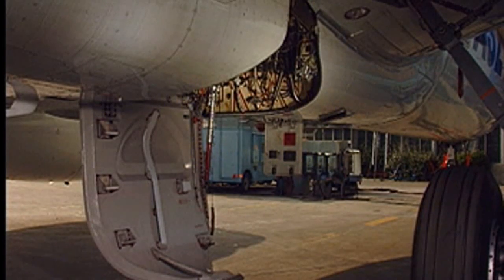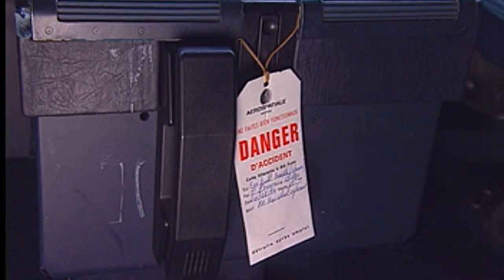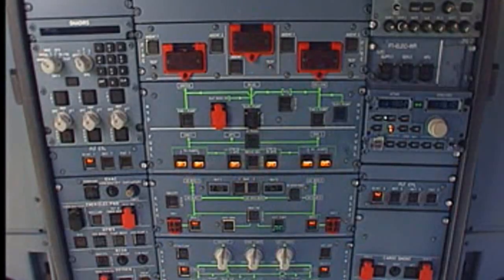After servicing, the door can be closed. Here are the precautions that have to be taken. In the cockpit: landing gear control lever down with the warning notice in position; landing gear free fall crank handle in the normal position, folded, with a warning notice in position; green hydraulic system depressurized.